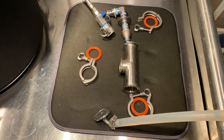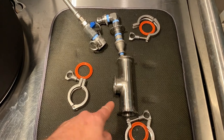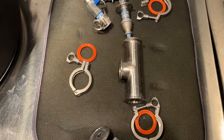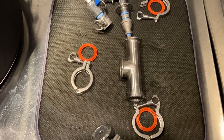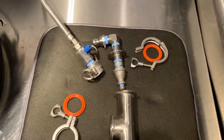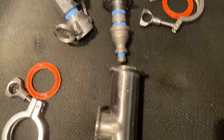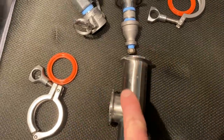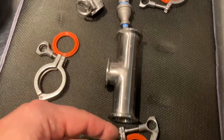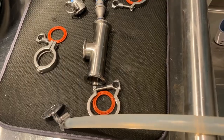So let's go through the components of the steam condenser. First up, we have the instrument tee. It's different than a normal tee in that this piece here is short — that's going to get it up tight to the kettle, and it's the right choice for the steam condenser. At the top here I've got my spray nozzle, and that's going to spray cold water into the body. It's going to be drawing in the steam from the kettle and taking it out of the bottom into this drain tube here.